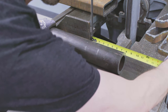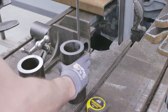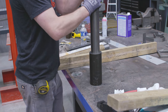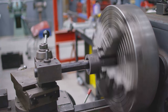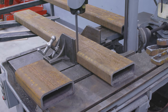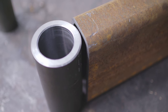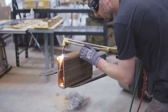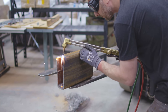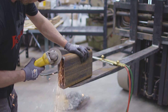It's time to move on to the pin sleeve. I'm using some half-inch wall DOM tubing that measures about two and a half inches inside diameter. The pin-to-sleeve clearance is way too tight, so I'm going to bring it to the lathe and open it up about 20 thousandths of an inch — that'll give me enough movement for grease and make it pivot nice and smooth. With the pin fitting perfectly, I now need to address the gap between the sleeve and the tube itself — it's too big to weld, so I'm going to do some coping to shrink the distance, doing a bevel cut and a cope at the same time with the cutting torch, then a light grind.